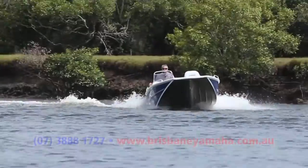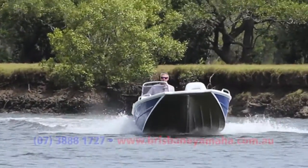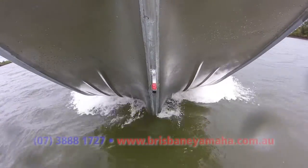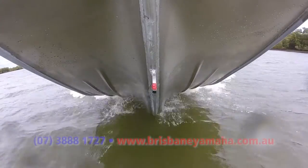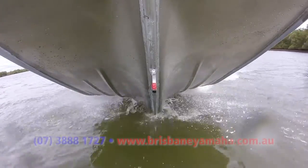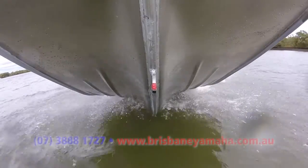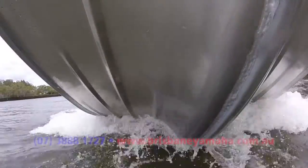The design of the eclipse hull with the flare at the front is really made to cut through the chop, to give the boat a much smoother ride and cut through rough conditions. It continues well down the length of the boat, so it rides nice and well through the water. But the other side of that is you do need a little bit more horsepower — the deeper the V, the better the ride, but you need more horsepower to get it up and going.